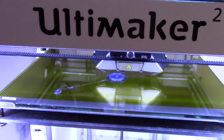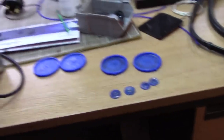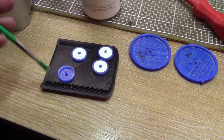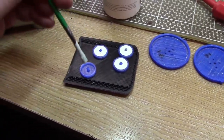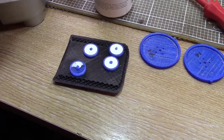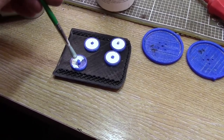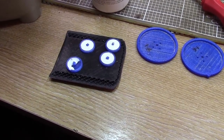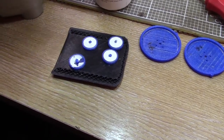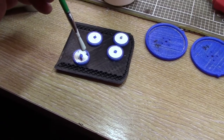I'm going to reassemble the compressor with those in. My little valve moulds are off the printer and I'm just filling them up by dripping the latex in off the brush — it spreads its way around. I'm trying not to get it on the centre pin because I want it to come out as a clean moulding. I have to leave this 4 to 6 hours, or probably 10 to 12 hours realistically, so I'll find out tomorrow if this is working or not.